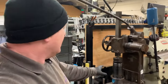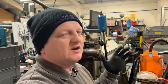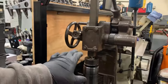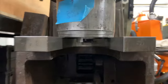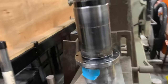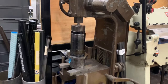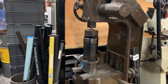I'm not putting it back in the machine for that. So we're just going to put it on the press, because obviously there's a set amount of pressure - I think it's between 800 and 1500 pounds. The Haas manual says it's meant to be pulling up on the tool. What I'm going to do is put it in the arbor press here, with it just sitting outside the spindle, not actually touching, just on the case. I'll put the tool in whilst pulling down on the handle, and that should work without any issues.